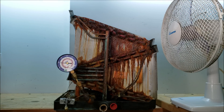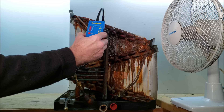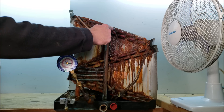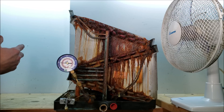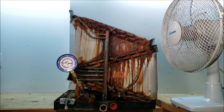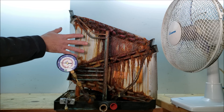Before we get started, let me show you how the ultrasonic leak detector works. We have a leak right here. The ultrasonic leak detector works best right after you shut the refrigerant compressor off, because you have oil on the inside of the tubing and the pressurization is escaping through the oil to make a squealing noise that's actually ultrasonic. We have just under 100 psi of a pressure test on this evaporator coil. You can also wet the coil down before checking, which helps the squealing noise as the pressure escapes through the tubing. The evaporator coil in cooling mode is usually already wet.